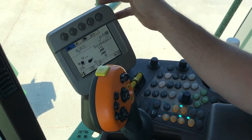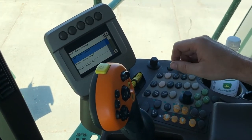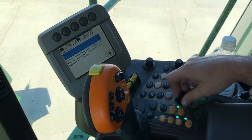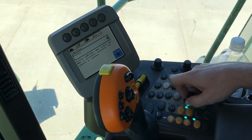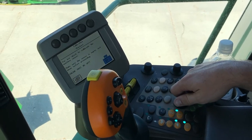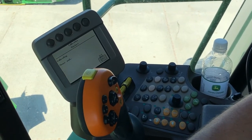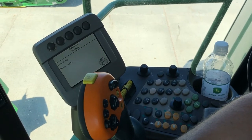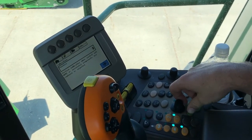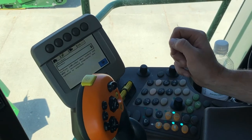Now we're going to do the moisture sensor calibration. We'll hit our book with the wrench a couple times to get to our calibrations page, hit the check mark, then scroll down until we see moisture. Basically, if we have to replace the moisture sensor for any reason, or if we go in and adjust the plunger at all, we'll want to do this. It says we're about to calibrate the moisture sensor — it needs to be empty and clean, and the engine must be off. As we do this, it's going to cycle that plunger inside of the moisture sensor. If it cycles successfully, we're going to get the calibration complete. That is how we calibrate the moisture sensor on the 70 series combine.